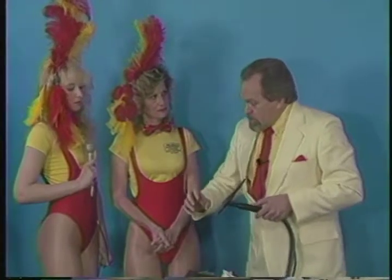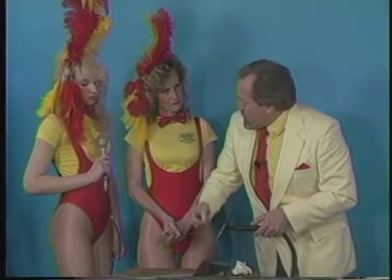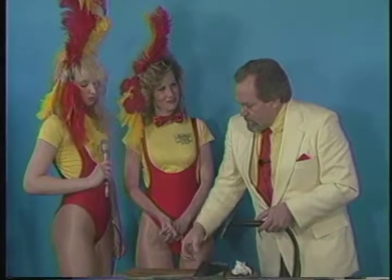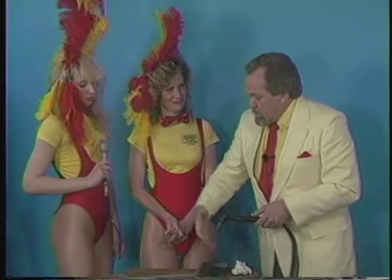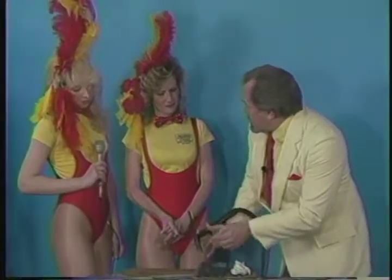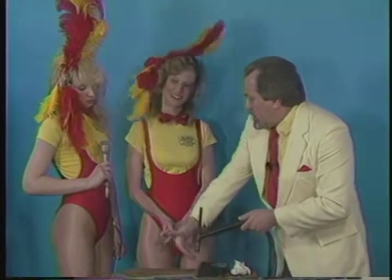All right. With AC, it's an alternating 60 cycle per second alternating current, and that tends to break up the oxide that's on there. Now you've got it surrounded in a pocket of inert gas where the oxide isn't going to form, and this violent process of these electrons banging back and forth to the aluminum and back actually breaks it up like a shale surface. They actually break up that oxide, and because now it's surrounded with argon, it doesn't reform. So while you're welding and adding the material right there, you don't have that oxide. As soon as you've passed by it, the oxide is reforming on the weld, immediately.